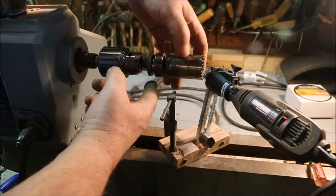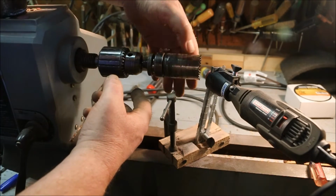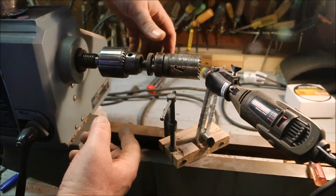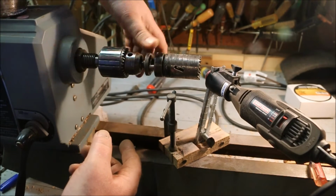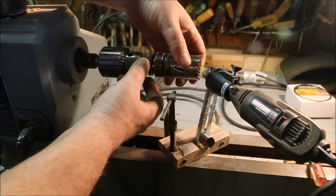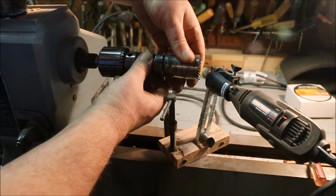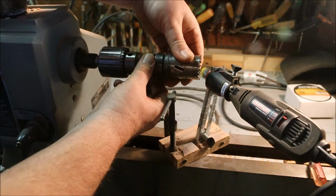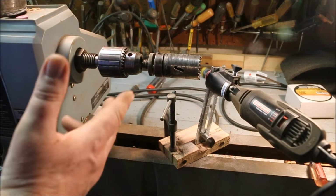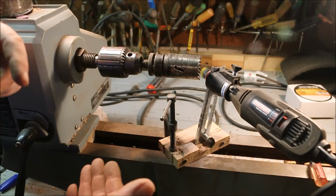This arbor is just an old arbor that was in the jar. Some kind person went in and cut the pins off, thinking that they were in the way, I guess. The pins no longer engage the hole saw. They'll come up against the bottom and kind of rub against it, but they don't really lock it in. Need to make new pins or find new pins or just use this as a hole saw arbor in a pinch.